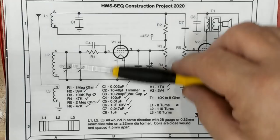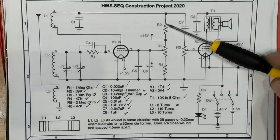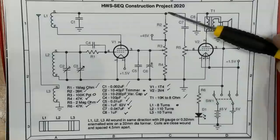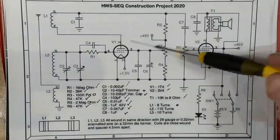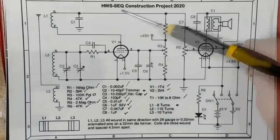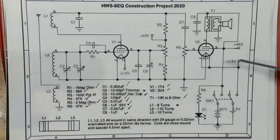It's powered by batteries. There are three coils all wound on one former. There's the tuning capacitor and a little trimmer. The signal comes in, gets amplified through a little tickler circuit, comes back around — some goes to the grid of the output valve, and some gets regenerated back in. The audio signal comes through, does it all again, building on the original signal and boosting it. There's a pot that limits the amount of regeneration — otherwise it'll start howling. You've got a little coupling capacitor and a volume control.